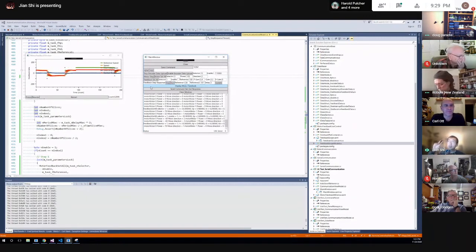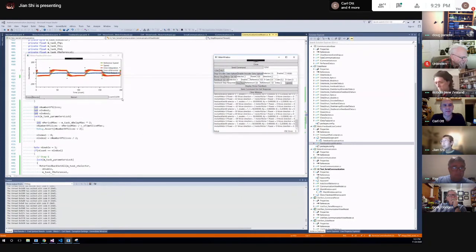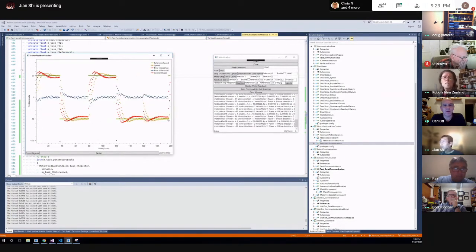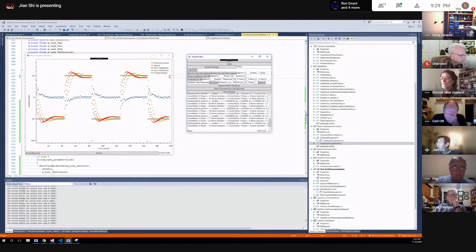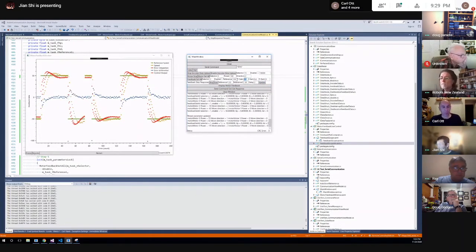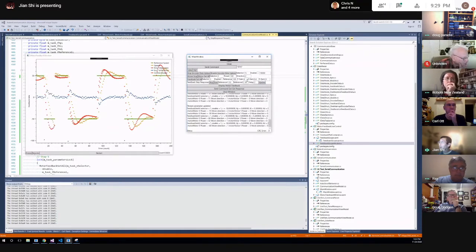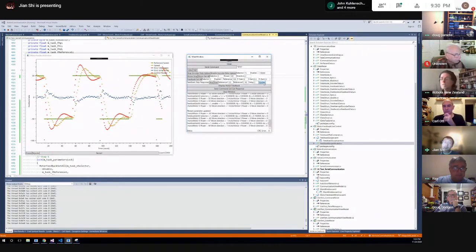I'm basically switching the set point around. It's going back and forth between two speeds, maybe. It closed in on the target speed pretty quickly. Yeah, I can try modifying these values slightly, just to see. If I put P gain zero, it'll have more overshoot. If I put I gain smaller, it will have less overshoot, but it'll be slower, right? Take longer time.